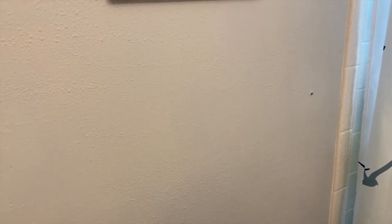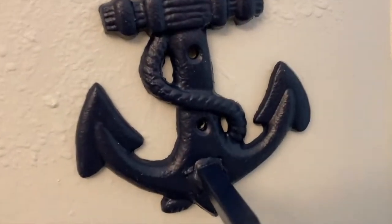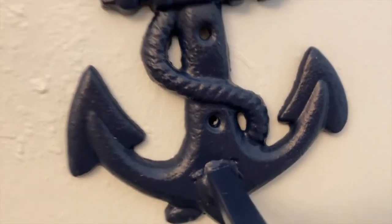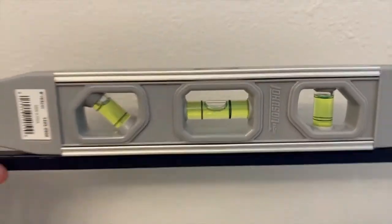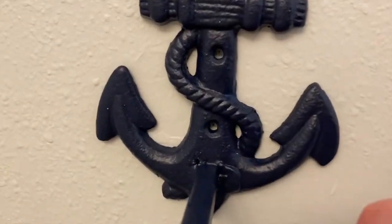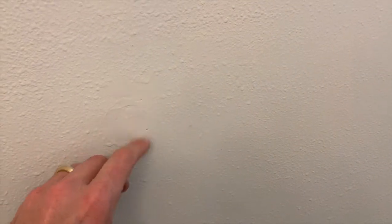In the event that you want step-by-step guidance on how to properly and safely remove a towel rack, definitely check out the link scrolling above. We are going to use one of the anchor points — pick up the towel rack, rest it in place, align it, and press in with a nail to get our drill points. The towel rack is shifted up and into place, and the bottom hole is aligned over that bottom anchor from the old towel rack. We are going to use a nail and push into the holes of the anchors after we properly level it.